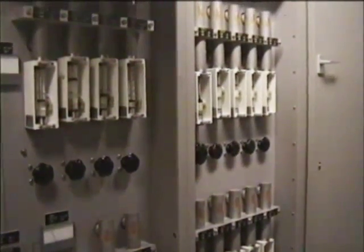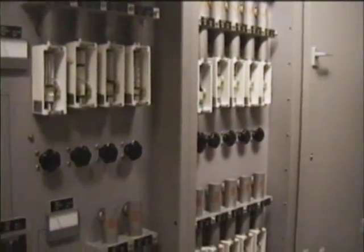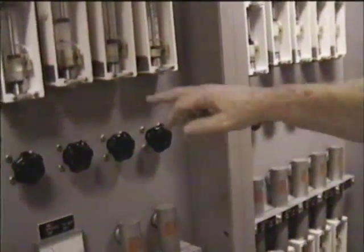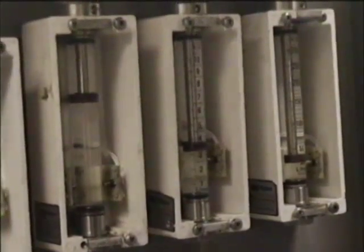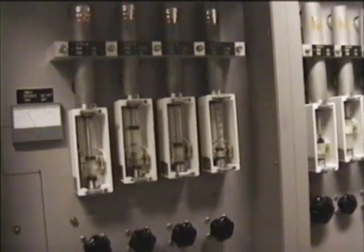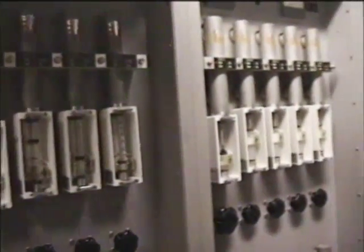Is this running now? No, it's in standby. There's a lot of noise — the water's going through. The water's running through it, the elements run with the water running through it. We run the water through it continuously unless we take it down to work on it. These are flow meters — most of them don't have graduations, but they tell us just how much is flowing in that circuit. We've got one here that's a constant source of problems — it's just barely above the line. Every so often we have to go in and blow the residue out of the line to get it back up, because it will shut the transmitter down.